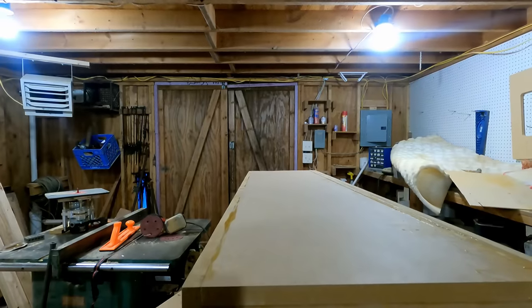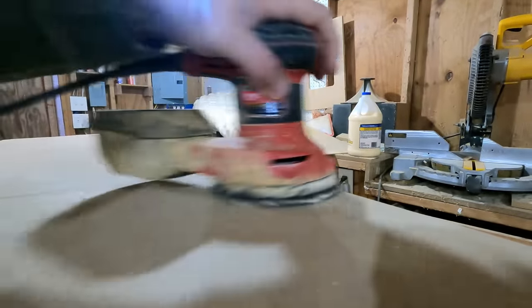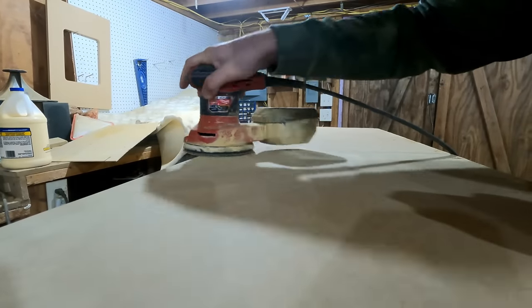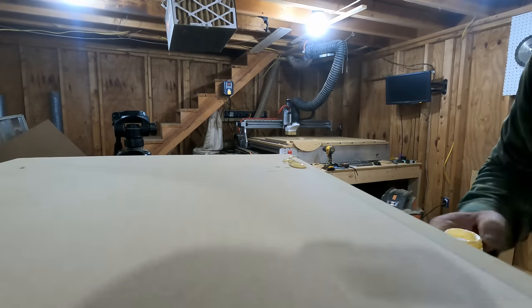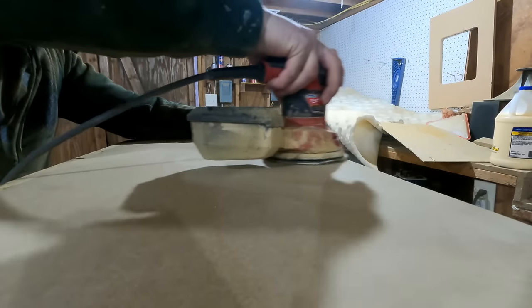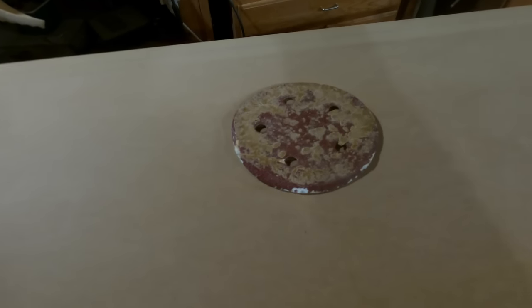We're already adding quite a few things to get sound quality where it needs to be, but that's still not the end. First, let's finish the enclosure. I'm going to sand this quite a bit, starting with a really rough grit like 60 or 80 grit sandpaper. When finishing speakers, you'll find that where MDF meets, sometimes glue doesn't squeeze all the way to the edge and you get gaps. A trick I've learned: pour a little wood glue on the seam and let it get tacky, then hit it with sandpaper again — the sawdust mixes with MDF dust and fills the gap. The downside is your sandpaper is done after that, so do it all at once.